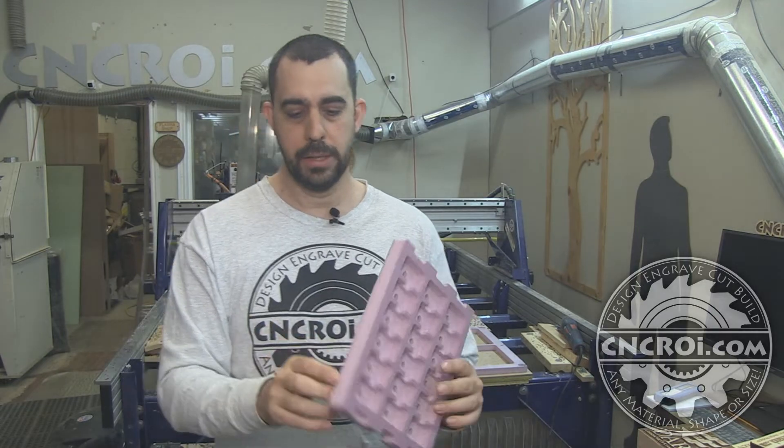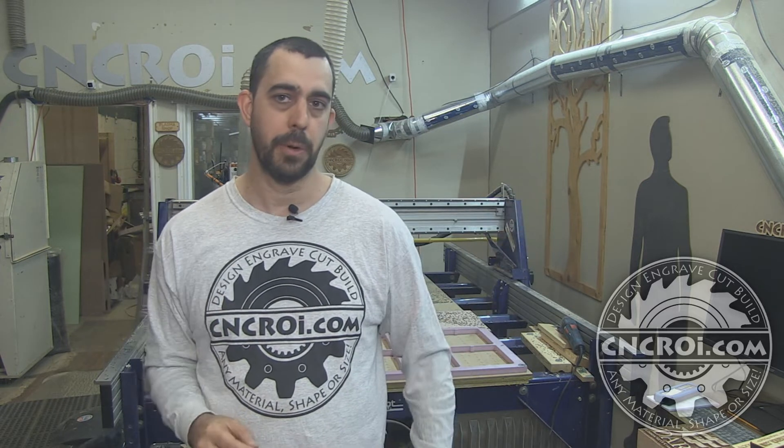You'll notice the machine goes up a little bit as it goes around — that's because it's making tabs. I sanded them off here. What the tabs do is prevent the part from moving on you. I have a vacuum table so it's sucking down, and I also have screws holding down the foam, but it can still move during production. So the tabs keep everything aligned, perfectly straight, and not moving while the machining for the whole foam board is done. Because the more holes you do into the foam, the less vacuum or suction you have since it's leaking out from everywhere.